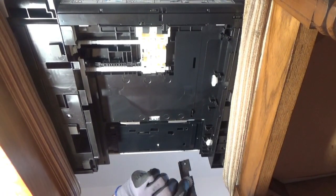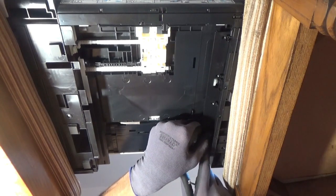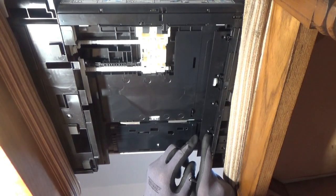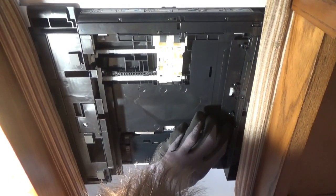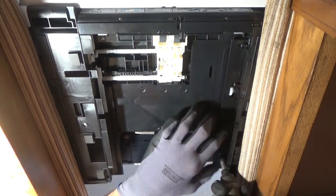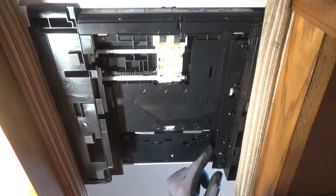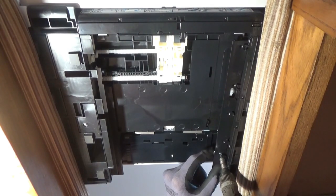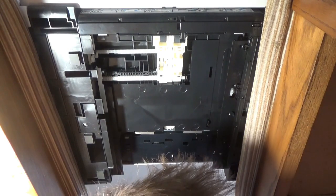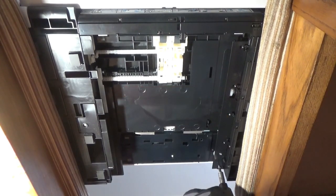Make sure this is flat on here — it's going to catch a wheel when putting it back on. Once you get it pressed in place and lined up, give it a little wiggle and you'll hear it catch the gear: click click click click. Then you can start putting your screws back in. Once you get one in it makes it a bit easier. Don't tighten this one all the way — leave it just a hair loose because if it's too tight it locks. I don't think it'll be a problem unless it starts making noise while printing. Let's put the front one in there.